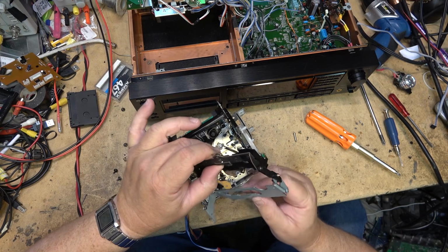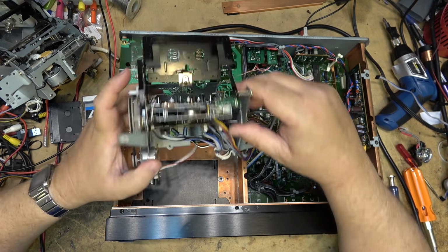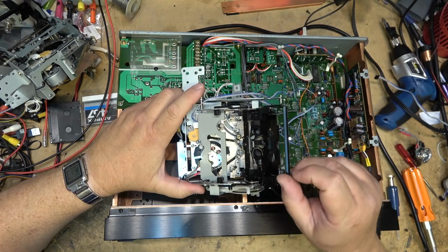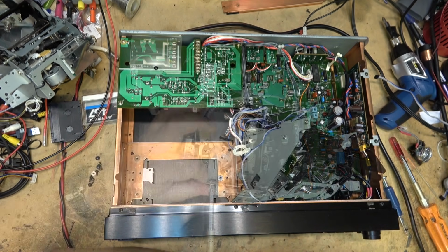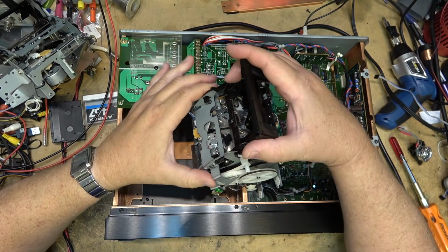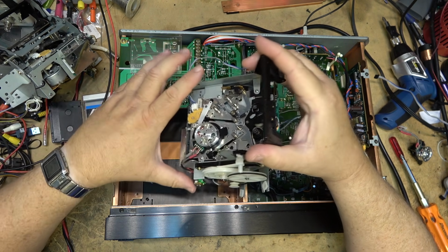And we didn't like it. Okay, and the other one, we'll remove the power connector for that bad motor. And I gotta remove the cassette housing bracket to get clearance, so that requires again taking out these screws. This clips in, it just rides along the outside track here. It's actually quite easy to take this piece out.